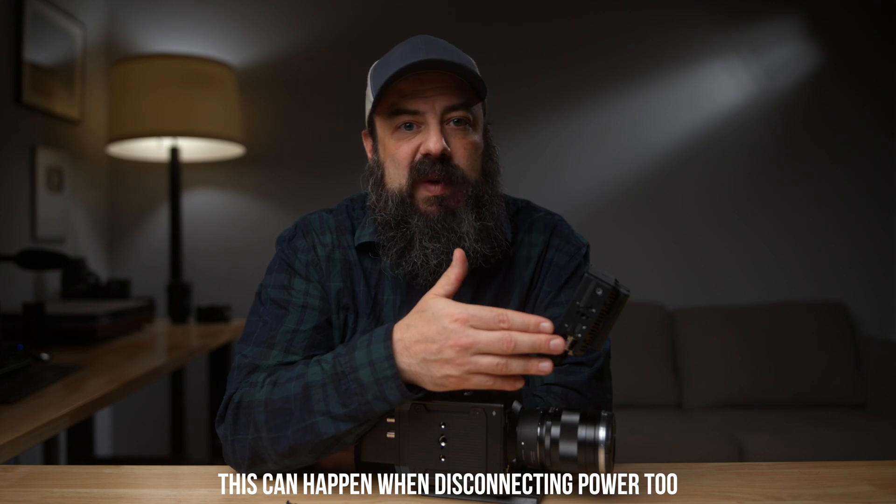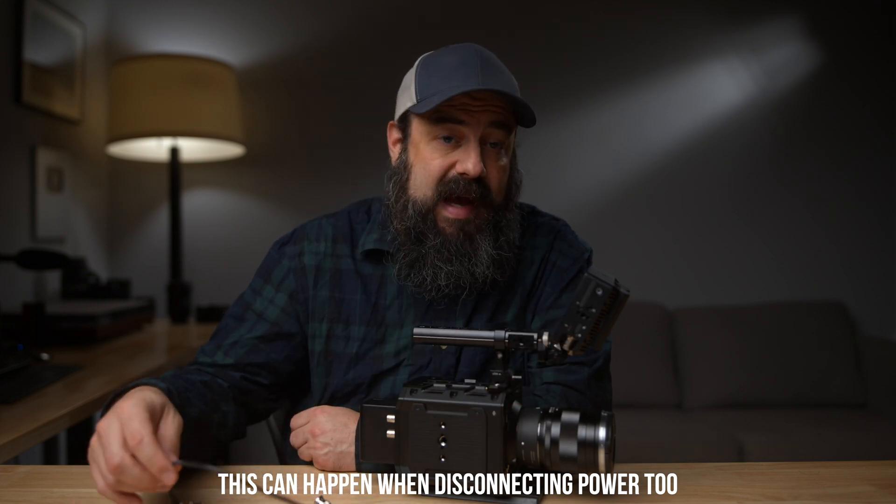Now let's get into talking about the SDI protocol and how you connect your SDI cable with your camera and accessories. This is not specific to Blackmagic or RED or ARRI. Before making this video, I looked around online to see if Blackmagic had their protocol listed — I couldn't find anything on their website or in the Pixis manual, but I did find some information from RED and ARRI, and I'll leave links below. Essentially it boils down to one main thing: you want to make sure that everything in your signal chain — your monitor, your video transmission, your camera — all have power and are properly grounded before you connect your SDI cable. What can happen is if your monitor and camera are connected over SDI and then you add power to your monitor, it can create a ground through the SDI cable, short circuit, and break the SDI port in your camera.